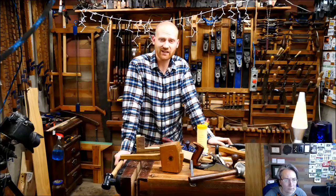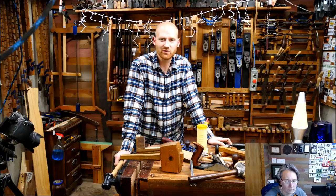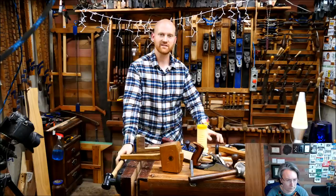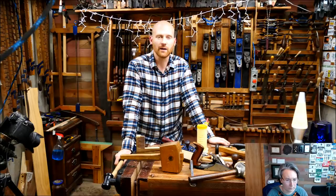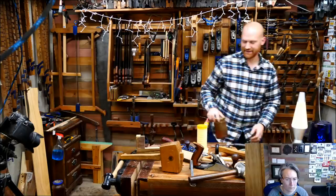I like a really wide dovetail, and people yell at me for using a 1:5 in hardwood. But I like the look of it, and it's going to work just as well, no problem. So do what you like. If you like those really wide dovetails, then get your 1:6. If you like them to look very narrow and tight looking, then get a 1:8. But honestly, between the two, there isn't that much difference. But there are a lot of people who argue about that. Cool. What else we got?